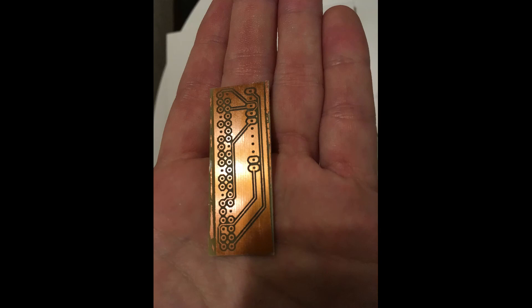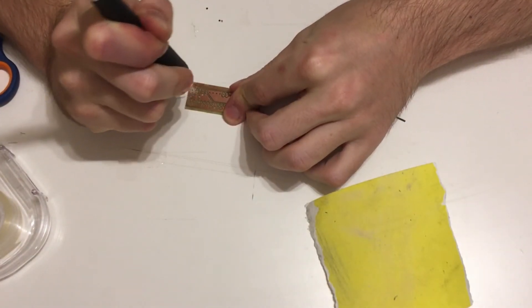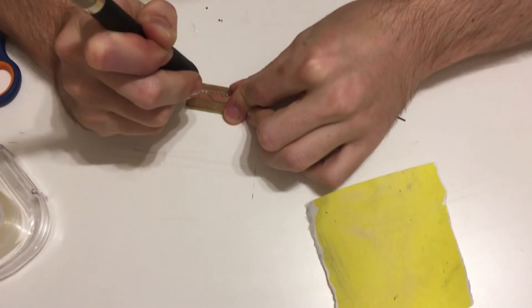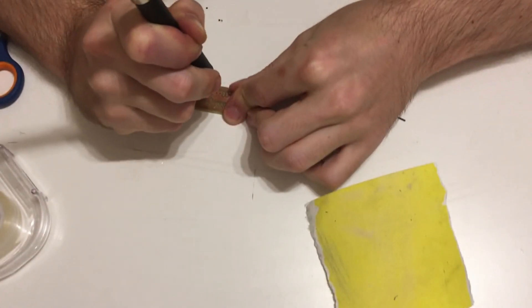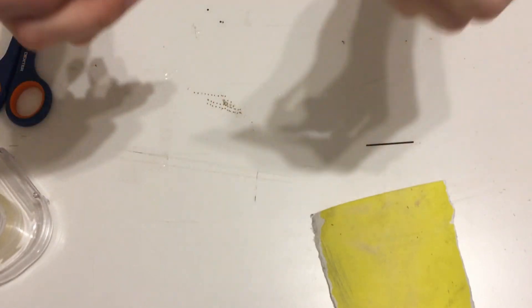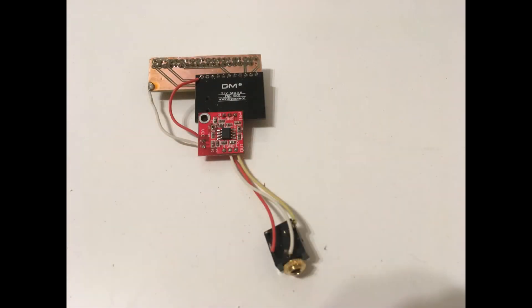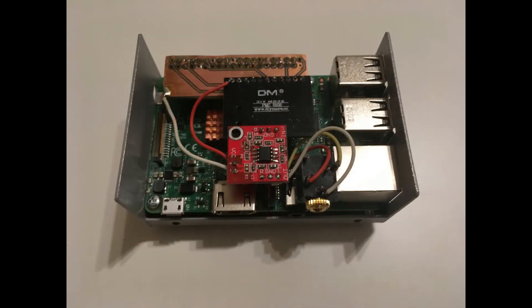The final step is drilling holes in the board. Be careful — I'm using a 0.7 mm drill because I have gold pin connectors in the board which are that diameter. The drill should be quite sharp, otherwise it might be troublesome, and keep in mind that this material — laminated glass fiber — is very tough and will dull any drill quite fast. The last step was to check all the connections, trim the board to the desired size, and then solder it. I mounted it all together and as you can see it's working — it's playing music and it's actually capable of driving 250 ohm headphones. I hope you enjoyed this video; if you did, please leave a thumbs up and if you are into interesting DIY projects like me, please subscribe.